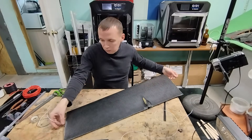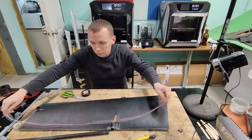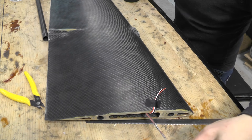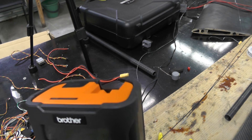I have two servos per wing, each with its own dedicated line. Redundancy won't hurt since the elevon is the drone's only control surface. I label the wires with self-adhesive tags on both sides of the wing.